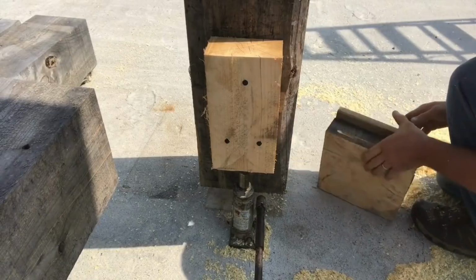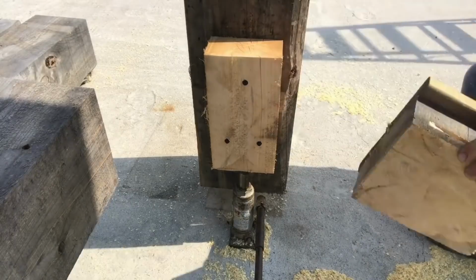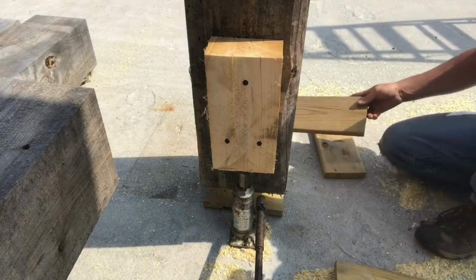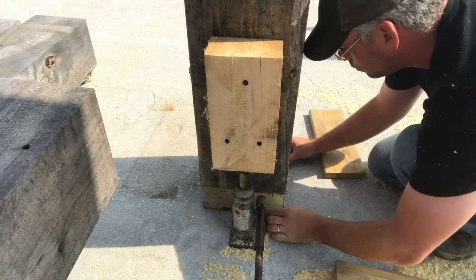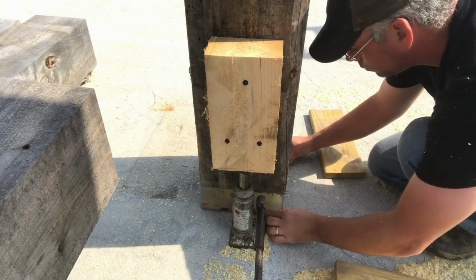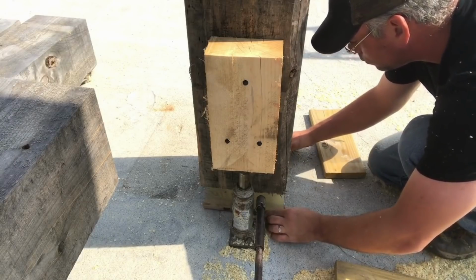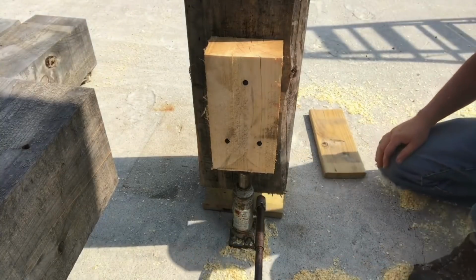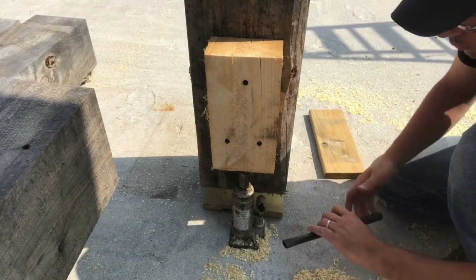I would rather use the chainsaw over a sawzall, very simply put. I can be a lot more accurate with it. The bar is so stiff, whereas the sawzall tends to wander all over the place. One of the first scarf joints I cut, I made the mistake of trying to use a sawzall to cut the middle 2 inches out, being lazy, not getting the handsaw out, and that thing wandered on me and I ruined the joint. I had to redo it.